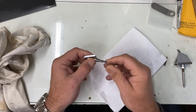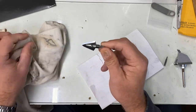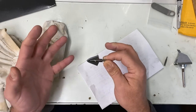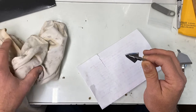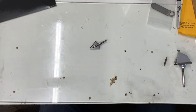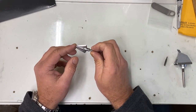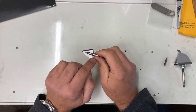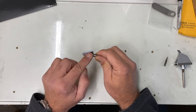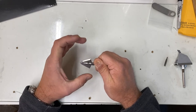That is Iron Wheel single bevel sharpening. You can go 2000, 2500 — you could go as far as you want. My whole goal is to not remove a ton of metal — remove as little as possible. Here's the thing: when you go through bone, dirt, sand, you're going to have to remove some material. That's why you weigh it. If you take a grain off one side when you sharpen, you want to take a grain off the other side. If it takes more off one side to get it sharp, go back and redo the other until you have an equal amount off both sides.